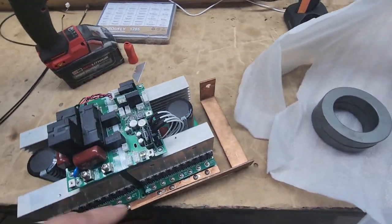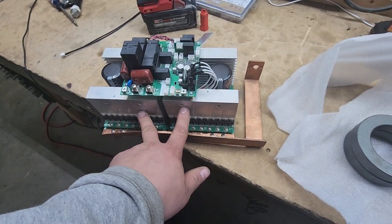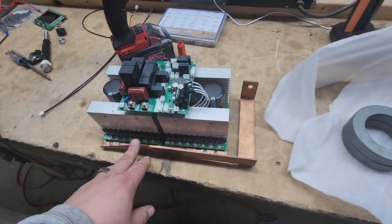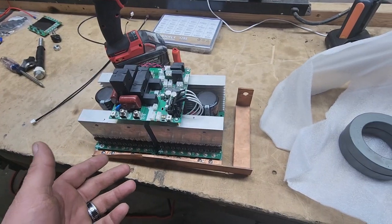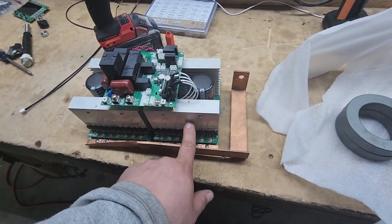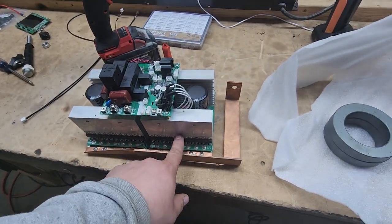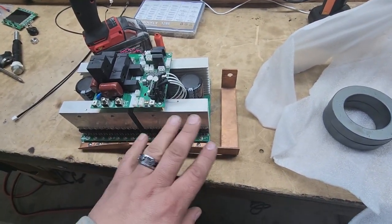There'll be one on that side, and then there will be, of course, one on this side as well. Now, in theory, these should both be the same temperature. They should be identical. In the PowerJect days, that wasn't the issue. But as much as I've tested with literally eight thermistors all over this thing, these have always been the same temperature. So I only need one here. You might say, oh, no, what if this gets really, really hot and you don't know it? Then we've got other problems. So putting one right here, there's already a hole for it, should be adequate.